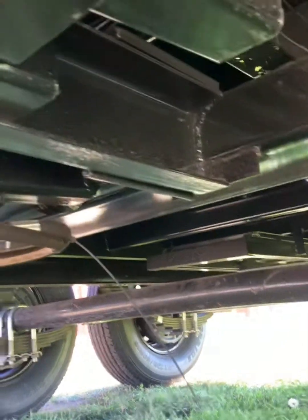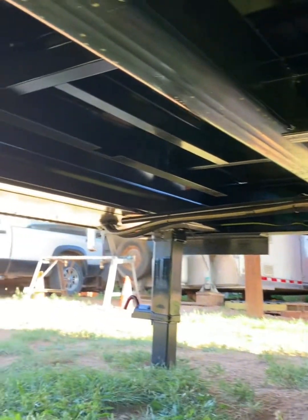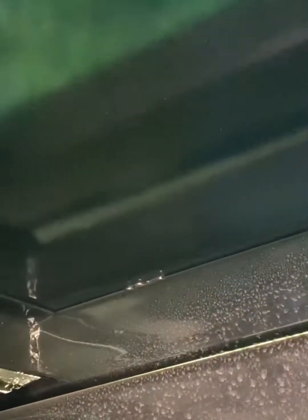This one has the scissors hoist with a very heavy-duty cylinder — I didn't measure the cylinder, but it's quite robust. You can see the hydraulic lines; they could have been a little better protected, in my opinion, in the bottom of the toolbox. In the very back, you can see the two heavy-duty sets of ramps. The ramps are quite robust. Everything underneath is powder-coated beautifully. The welds on the bottom look sufficient, and most of the welds look pretty good quality.